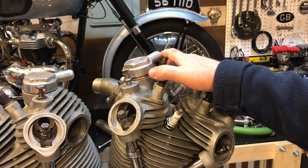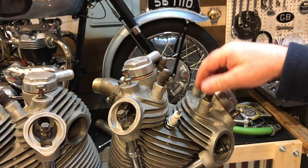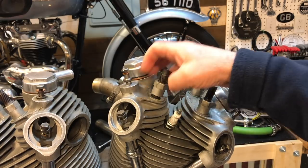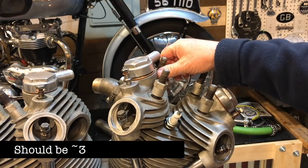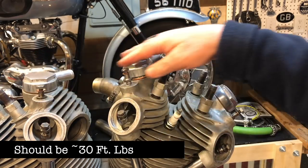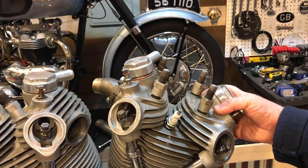That's the cylinder head brackets — the mounting brackets — removed now. I was just feeling these cylinder head bolts and I realised that these are loose, certainly on this side anyway — loose by hand. These are locked down on the other side. So inevitably, I think what I'm going to do is take a look and see what it looks like inside this cylinder head.